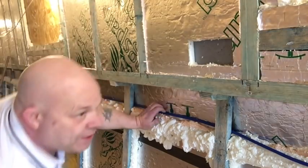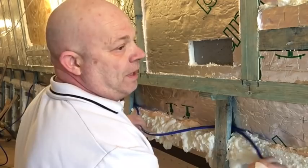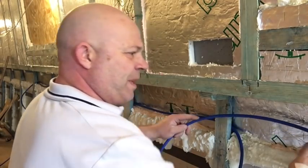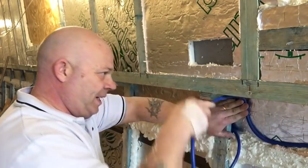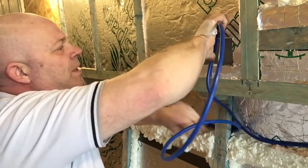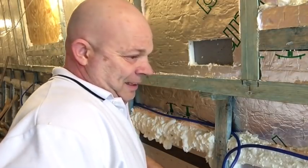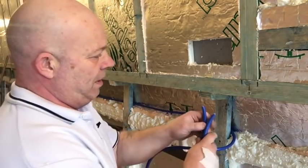Let's get me side cutters. Pull a bit of slack through. And then best to leave as much. So obviously my cable's got to go back there. Then underneath and through. So let's leave a nice piece just to make the connections in the back of the box. So that's that one. Pop them both up.